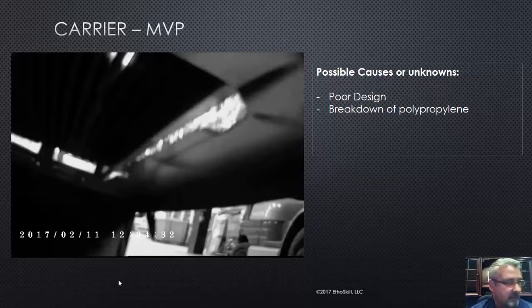Why does polypropylene break down in these heat exchangers? When you condense in that secondary heat exchanger, that condensate has an acidic value — it will eat and corrode metal. If there's any breach or breakdown of that polypropylene, eventually it'll work through and penetrate the metal, eat through it. As a 27-year veteran, I'm guessing that expansion and contraction, vibration from the inducer motor, the blower motor, number of cycles — all of that eventually separated the polypropylene. Once separated, the condensate got at the metal and caused problems.